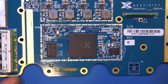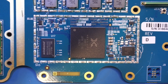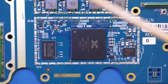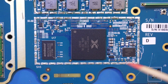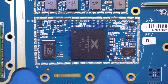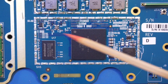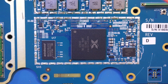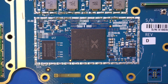Now let's move up a little bit and we can see the section below. This section underneath the second shielding can appears to be the brain of the signal booster, so to speak. The larger chip here is a Nextivity-branded proprietary chip, and unfortunately I could not find any information about it. But given that it has a companion flash memory, an SRAM, and multiple voltage rail supplies from the DC to DC converter section earlier, I assume it is probably an FPGA, ASIC, or processor of some sort.